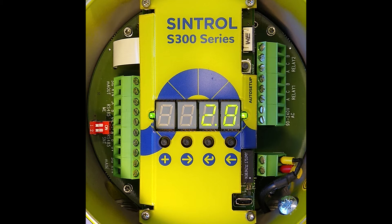Very important: run the Auto Setup always during running production. If production stands still and you have no dust, it will give you a ridiculously low threshold because there was no dust — 20 times zero is still pretty much zero. Remember, when you press Auto Setup, production must run. You need to have dust.